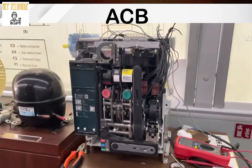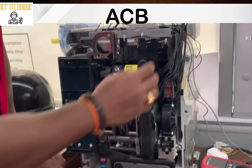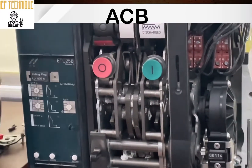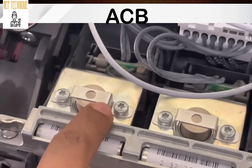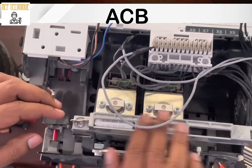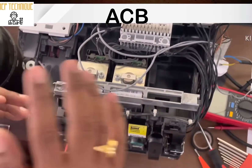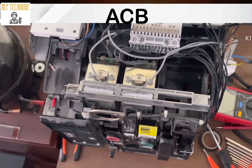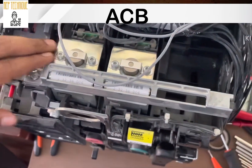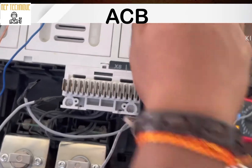Once I start charging, the spring takes tension and this mechanism comes out. These are the shunt trip coils, operated by 230 volts — I have disconnected the cable just for demonstration purposes to show how we can check the shunt trip coil. If you want to operate the breaker by an external on/off push button, or add protection like arc fault or under-voltage protection, you have to connect the shunt trip coil, as this is the only way you can control your breaker externally. This here is the sliding connector.